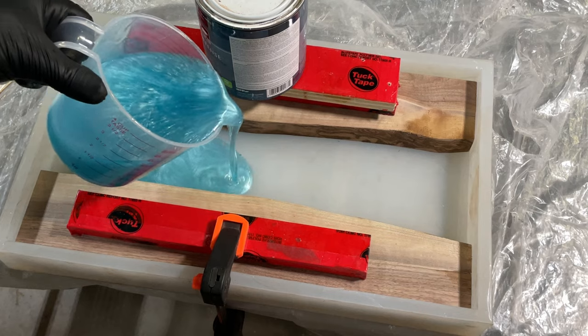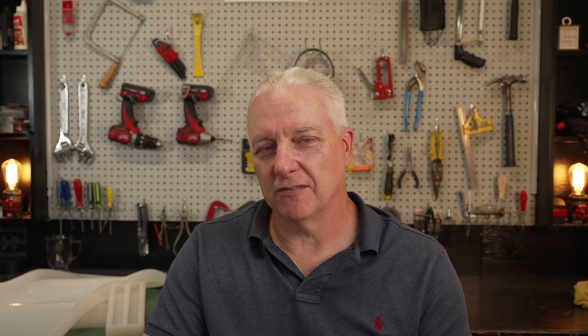A few people have asked and they're really not that hard, so I just wanted to go through the steps I do to make them. I typically use these for making things like charcuterie boards where I pour epoxy resin in between two pieces of live edge walnut or some kind of hardwood, and it saves a ton of time. Normally what you would do without one of these is create a wooden form, use immense amounts of mylar or poly tape to seal up all the holes and make sure nothing sticks. Maybe you use some mold release, and when you pour your resin two days later you have to tear all that apart and do it all again the next time. With a silicone form you drop the boards in, do the pour, you're guaranteed no leaks, and two days later you just peel it off — it simply does not stick. It's a much faster, much easier way and you get very predictable results.